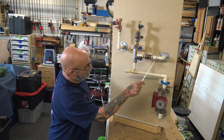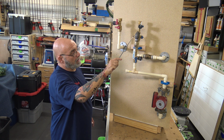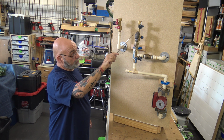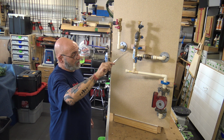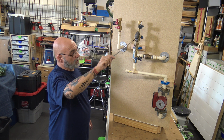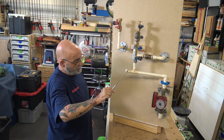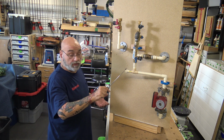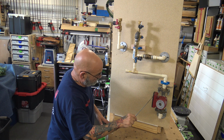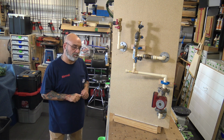So again, cold water check valve into the water, flush valve kit. If you don't use the dedicated recirc, you put your T here, your bleeder. Other than that, brass fittings, T, the bleeder port, your aquastat, or if not, you could put a drain here if you wanted to. And then back in, and then you wire it to a smart plug. But I'll go over the wiring in the next video.